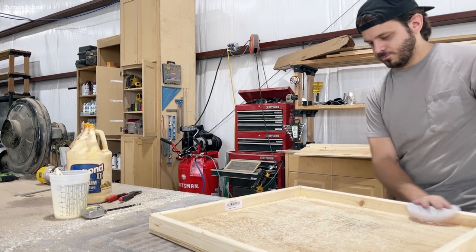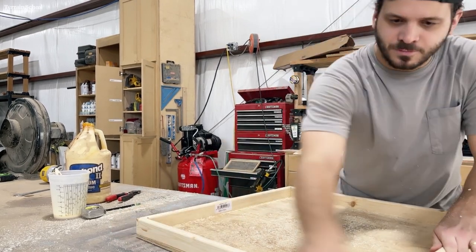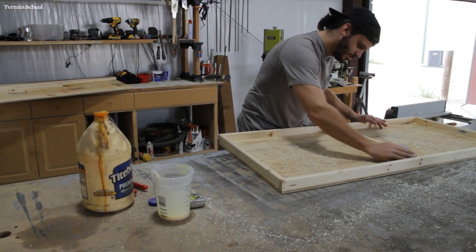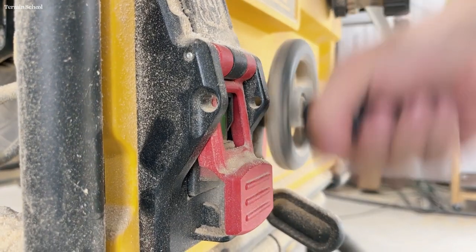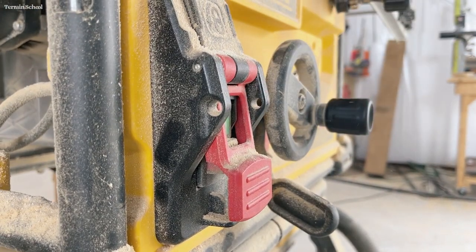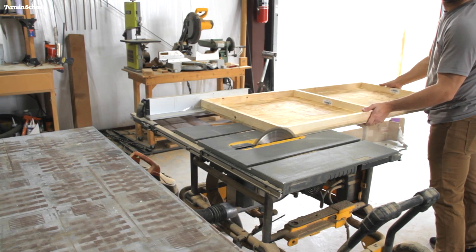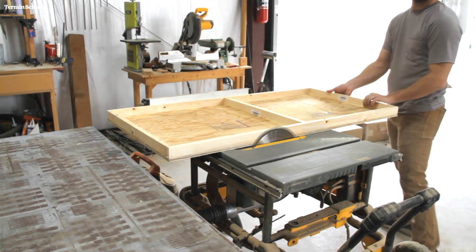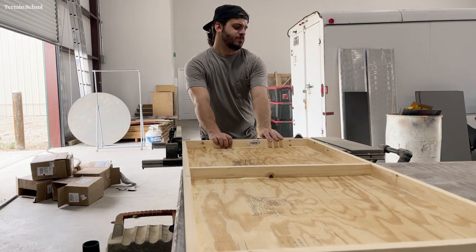After I give this a route, I'm just going to clean up the burrs and the corners with a sanding pad by hand — not doing much other than taking off any major flyaways from routing and making sure I didn't gouge the wood or the wood grain didn't pop out. The boards ended up not being quite true — they were pre-cut — so even though all the boards I cut were the same length, I decided to just trim up on the table saw, taking off maybe a 64th of an inch to make it more flush.